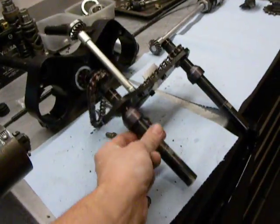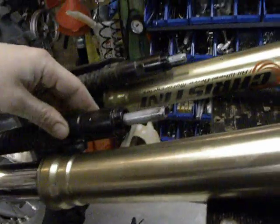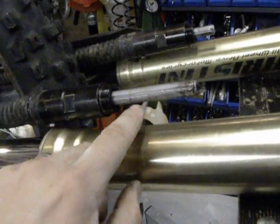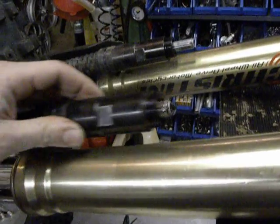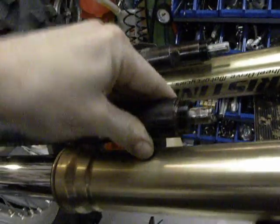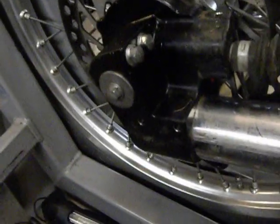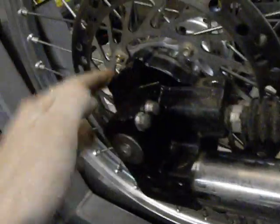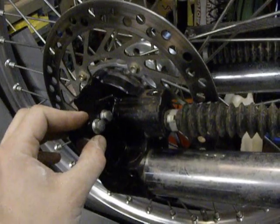So the counter-rotation then goes to these guys. You can see where this spinning from here goes to this — and this is the crux of it, this is pretty cool. These are linear bearings riding on little grooves, and they only go one way. I can't turn it counter-clockwise; it has to go clockwise. Because inside this — which is yet another gearbox — is a bevel gear transmitting to the front. But in the hub are sprag clutches, one-way clutches.